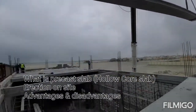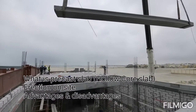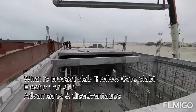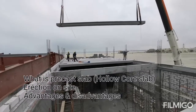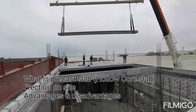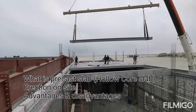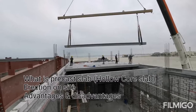The length of this span is 12 meters — you can see now they are erecting it. Lifting and erecting is very easy. Rapid construction on site and high quality due to controlled factory conditions are key advantages. Pre-stressing is easily done, which can reduce the size and number of structural members.